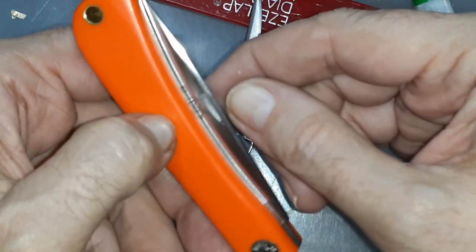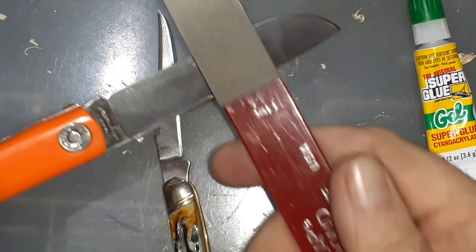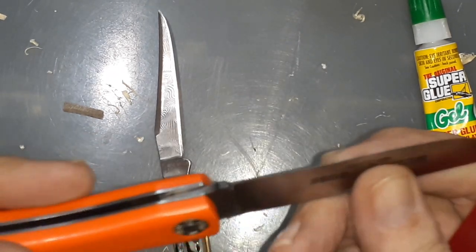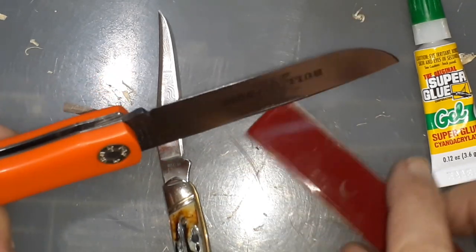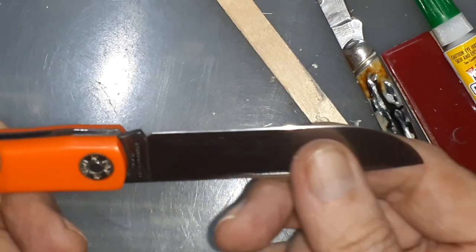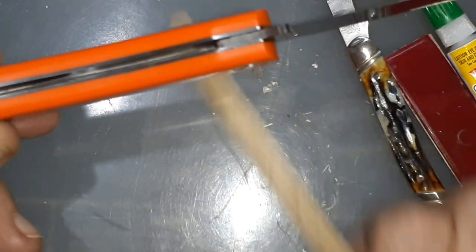So when you close the blade and let it just fall, it would line up with that bullnose. Now normally you just sit here — this is a fine diamond stone — and file out the pin wrap. If it's not significant depth going down there, it'll be like a dish shape, a half moon shape where it's hitting. Sometimes that'll correct it; just removing that much metal will correct it. But what you really need to do is get down in there.